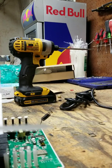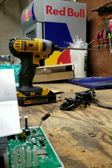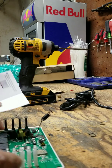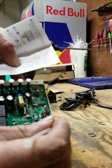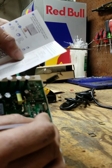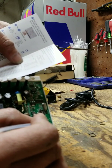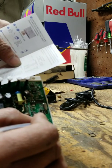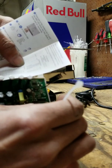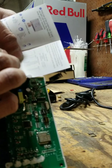Now that it's in, you basically want to control... So K6 is the time delay working mode. Right now it was in interlock mode. Everything on here — well, in this case I only want Relay 1 to do it. So I'm going to do Relay 2, 3, and 4 on self-locking mode.